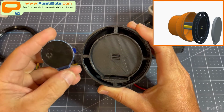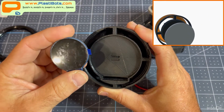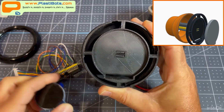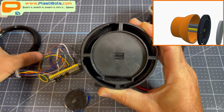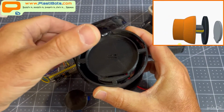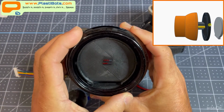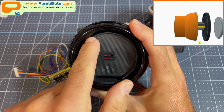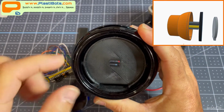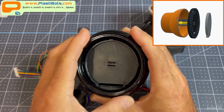The idea is that this is a very small screen, I think a 1.3 inch or 1.2 inch screen. I'm planning to have a 2-inch screen to fit this area here. You can see that with the vent ring mounted, I've got little detents here that will allow for airflow. You can barely see it here, and I can't really get any background lighting, but airflow will come through these little edges here and around. It'll still process some airflow, not a lot, but a bit.